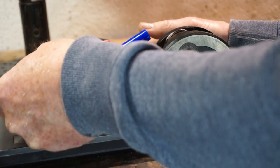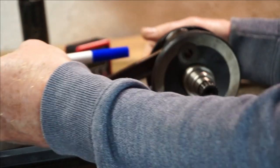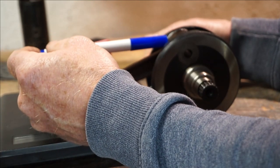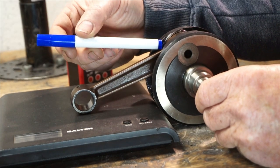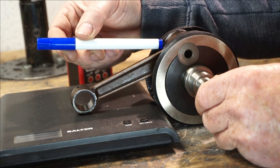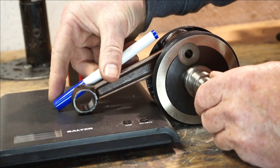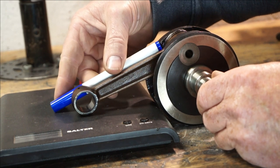But your rod is transmitting it up this direction. Now, the straighter the push on the pin, the straighter your push, the easier it is for that energy to rotate the crank. The steeper the angle, the more difficult it is for the energy to rotate the crank.